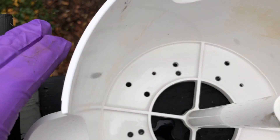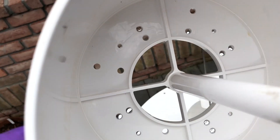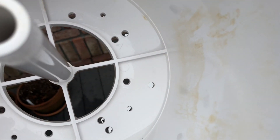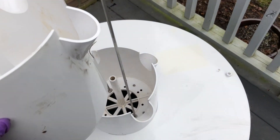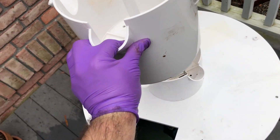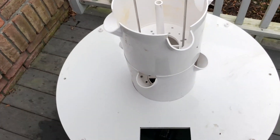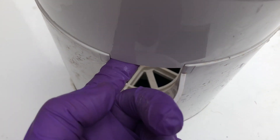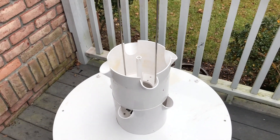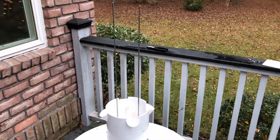That way they tier up in the right orientation. The next one will get threaded through the B hole on both sides, which will skew it about 60 degrees from the previous tier, so they sit on there offset. There's a detent on the bottom that sits down into the previous section, and you just alternate A, B, A, B, A, B all the way up to the top.